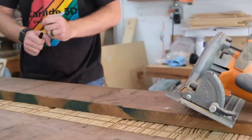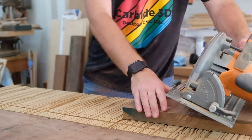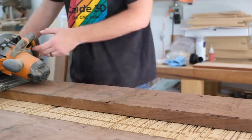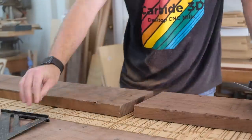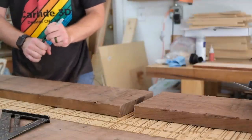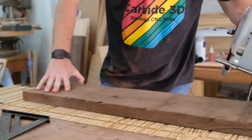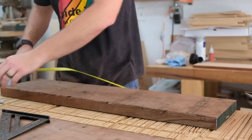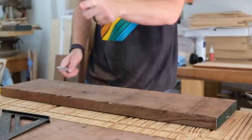So I'll go ahead and label that side as a side piece. I'll slide the board down and do my next cut. This is 32 inches, so I'll label this TB for top or bottom — I'll decide which one's the top or bottom later after I plane it up. And this last remaining piece is 32 and a half, so that'll be another top or bottom. And then I'll get my last side from that other board.